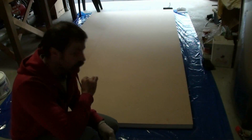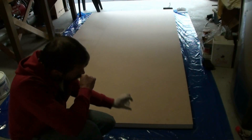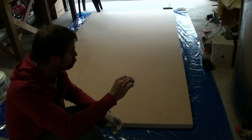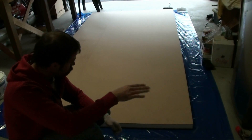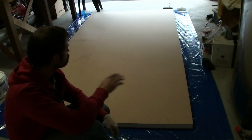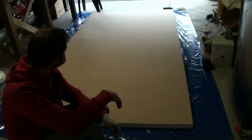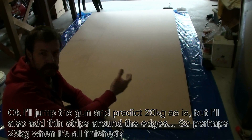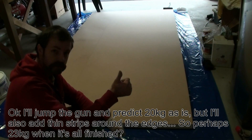What we have here now is a rather delicious-looking sandwich: MDF on the bottom at 3mm, then a 50mm dense polystyrene foam core, and then another 3mm MDF board on top, all bonded with epoxy resin. I'll give this about 2 days to cure given the climate. Then we'll check how stiff and light it is — I'll actually put it on a scale to measure the exact weight. Stay tuned for that.